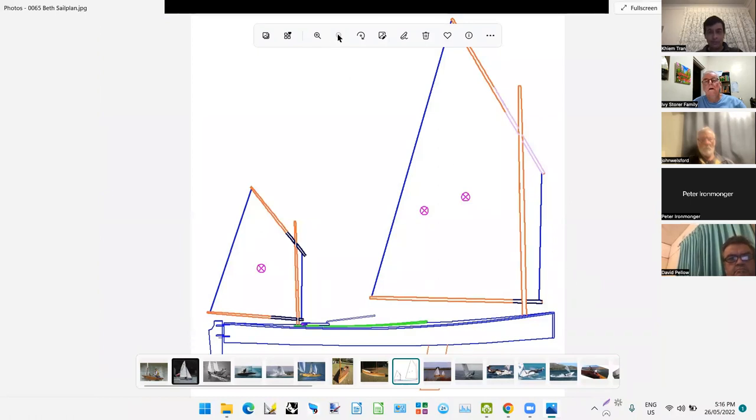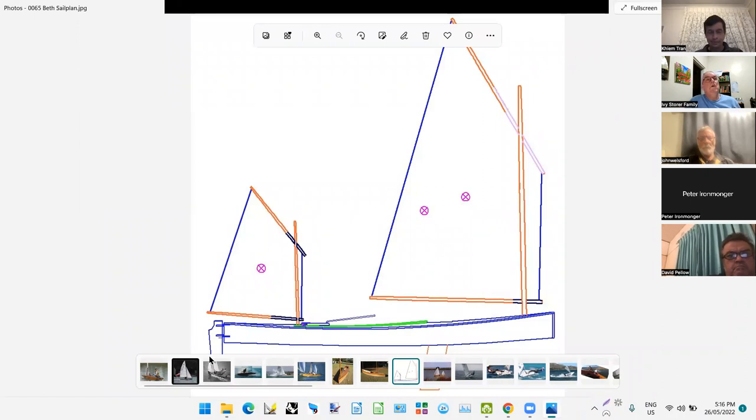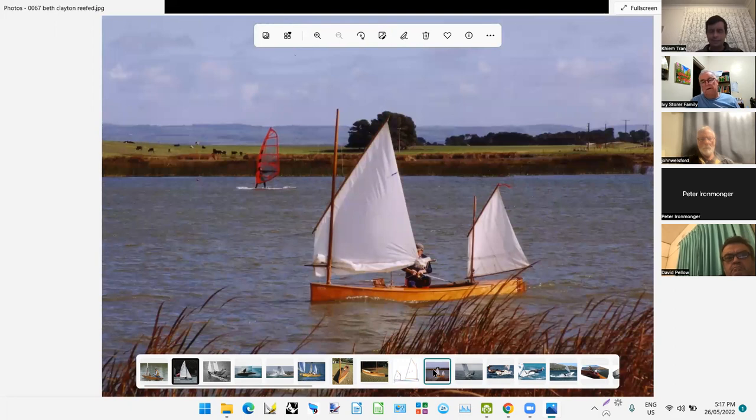One of the other things I tried was an absolutely tiny rudder. The rudder is not much deeper than the edge of the photo frame. Australia imported an E-Scow — one of the big American lake sailing boats, 38 feet — and they had two rudders that were absolutely tiny. What they rely on is that the scow shape is very balanced and doesn't have any weird handling effects when it heels. So I thought I'd play with that as well.